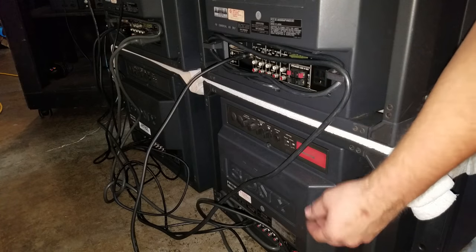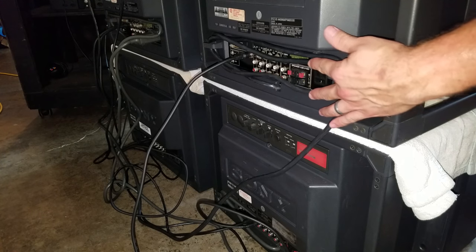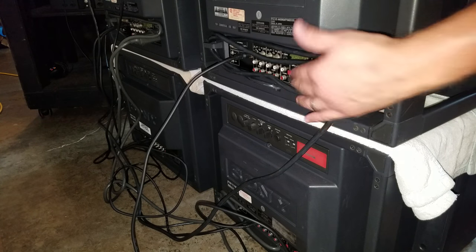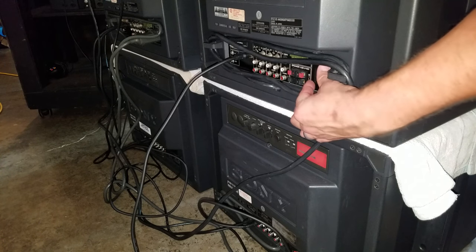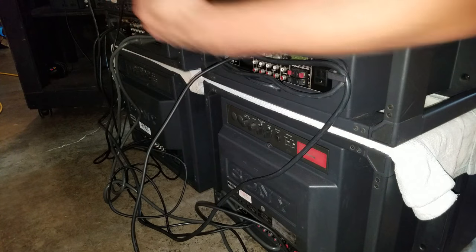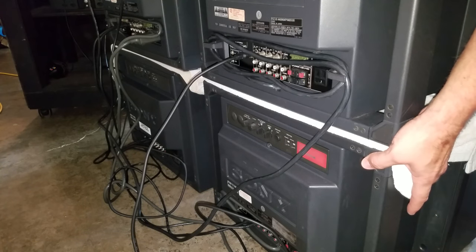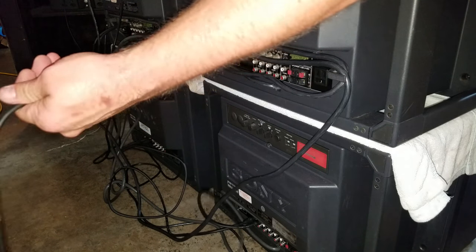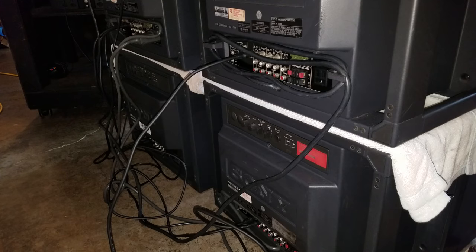Please notice that some of them do have a power outlet in the back. Two of them, the power outlets were disabled because they were used in medical devices and they weren't allowed to use it, so they're not actually working. The other two are working, but if they were all hooked up, you could hook everything in a loop, even on one power. I basically had to hook up two of the TVs to get it set up, but then I've got just a BNC cable for the composite loop coming out of every single tube output into the next input, and it follows from the VCR down. I don't have any sound hooked up today for this demonstration.